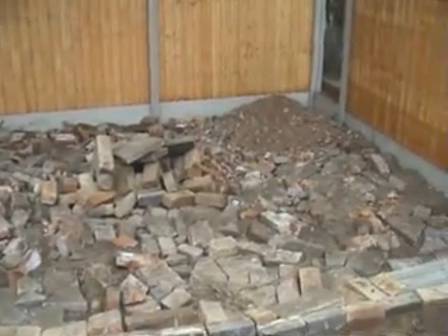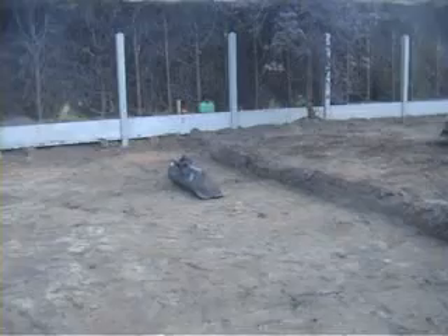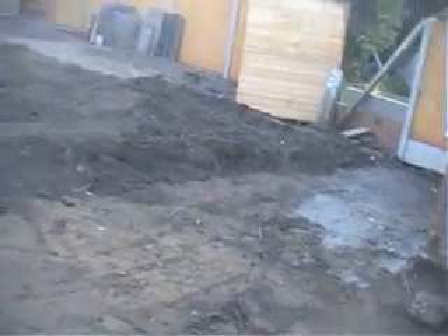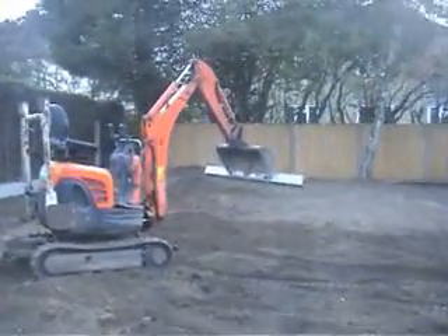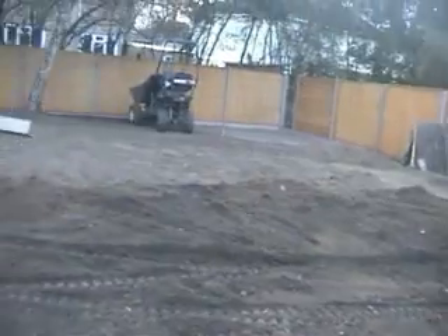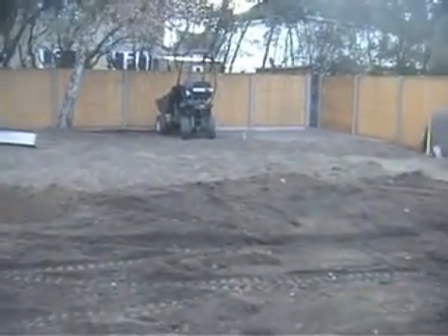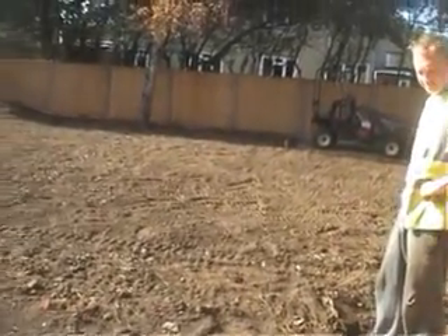It gave me a good place to get rid of all the structure that we demolished. Now I've completed digging out the patio area and got all the soil out of here onto the top level. I've put the rake attachment on the bucket, so I'm going to start distributing this ground and try to get an even level all the way through. Quite a lot of soil here, but it's better to go down a little bit yet to get compacted by the machine as I'm doing this. I've graded out this soil and redistributed it — now I've just got to get it all to the right final finish.